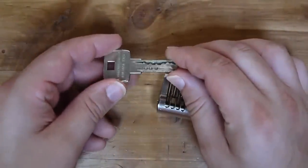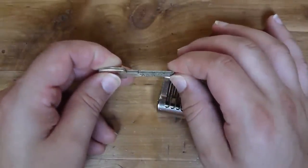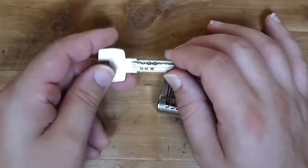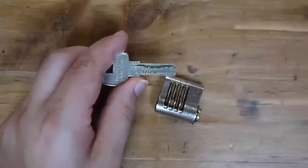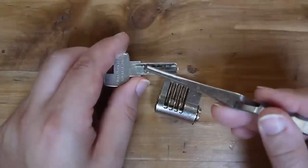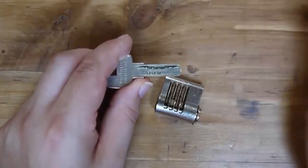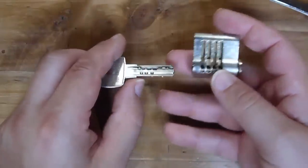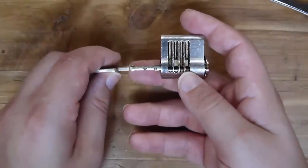However, with the Dom, they've extended these ridges up above the thickness of the key, and that gives them a much wider range of pin differences. Having a look here, we have a nice straight line, and this is also going to be mirrored by our pins, which are actually much narrower than you would imagine. I'll show you how they do that when we pop it open, but first let's just have a look at what's going on inside.